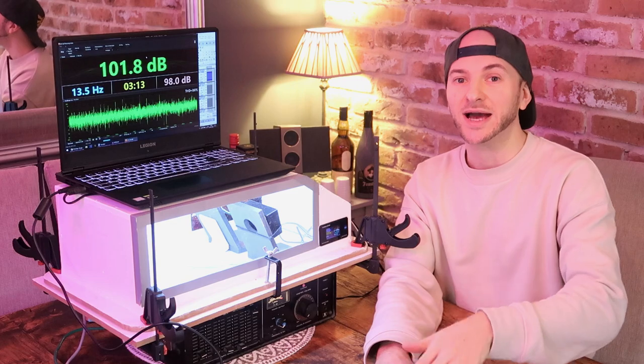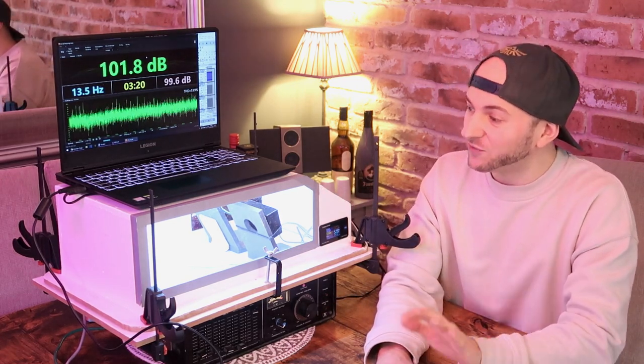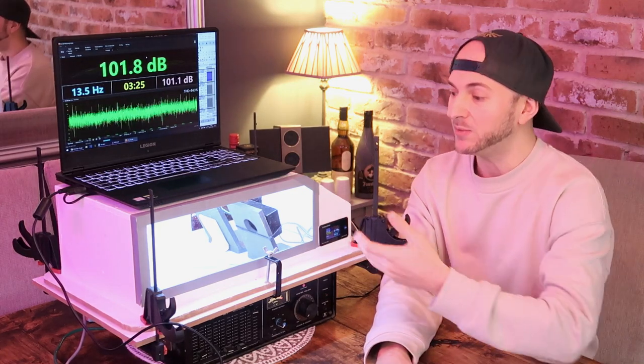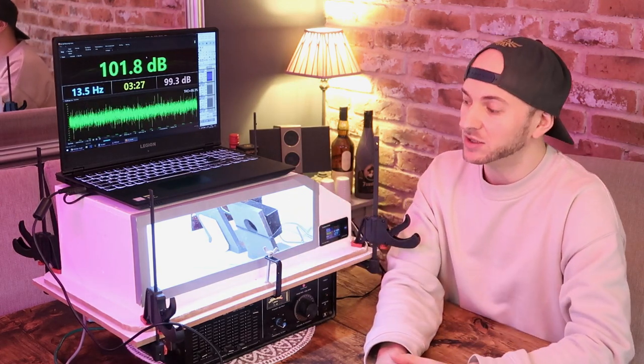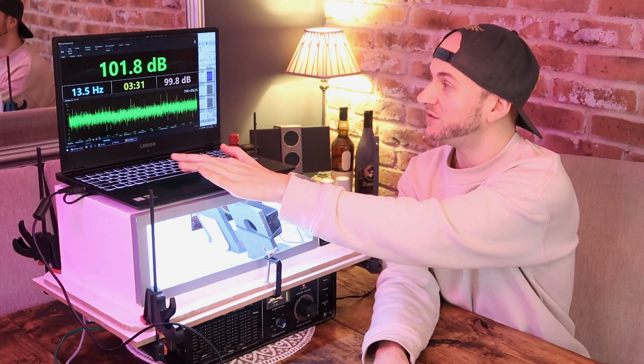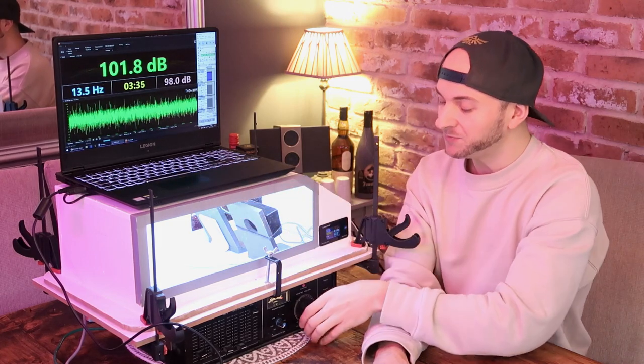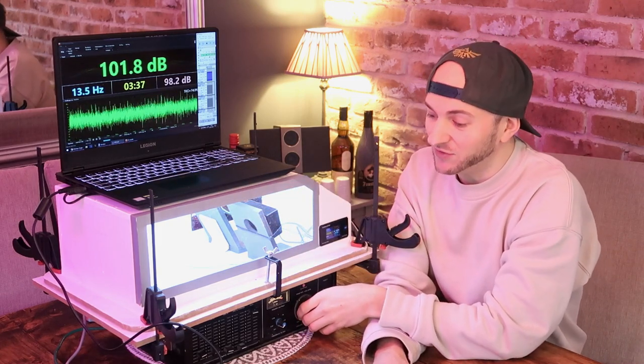We have the door open as always for the first test, giving this cabin a sort of 146-ish Helmholtz mode, and we have a quarter wave resonance of the cabin at about 180 hertz. So the first test is 25 scaled hertz, which is 150 hertz. Let's see exactly how loud we are at this lower frequency. Remember, we're pretty much unloaded down here on the impedance sweep.